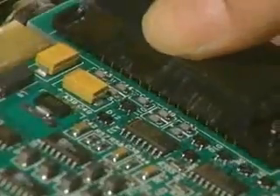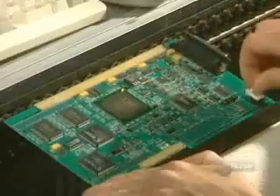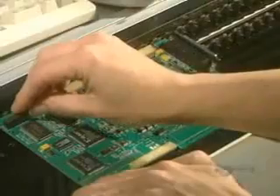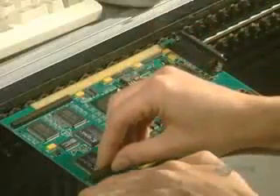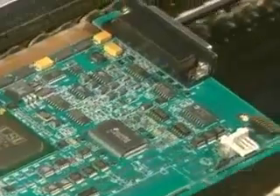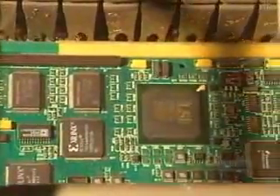Different circuit connectors through the card are inserted into their respective holes. This operation requires great dexterity and is entirely done by hand. The metallic placement points need to be soldered to the card. The soldering of the circuit components through the card is done with a bath of molten tin-lead alloy at a temperature of 240 degrees centigrade.